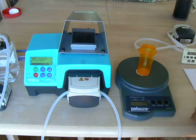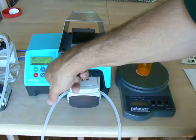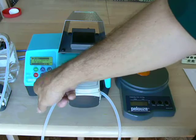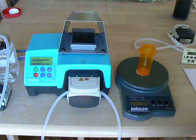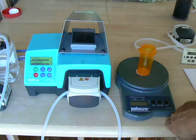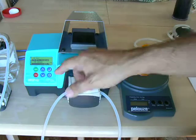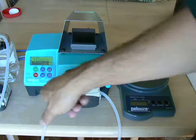Because it's a single point calibration, every time you calibrate it erases the previous curve. We've done that single point and now we're ready to dose. We're at the main menu, hit Enter. We've got a 30 mil dose set up. If we wanted to change it, we'd hit Enter and use the up and down arrows to put in a different dose. The next choice in the filling menu is Interval — right now set to zero seconds. Zero seconds means the pump will wait for an external input: pressing the start button, hitting a foot switch, or having some external machine actuate the pump. If you put a number in, the pump will dose at that timed interval and will ignore the keypad and foot switch.